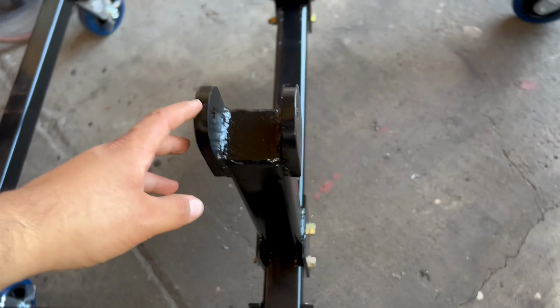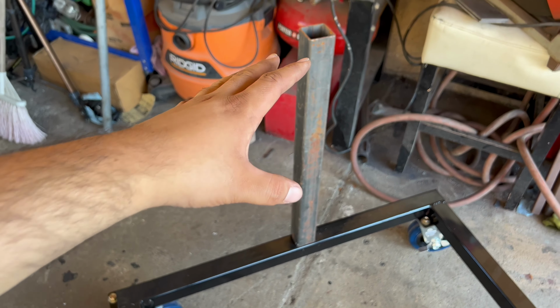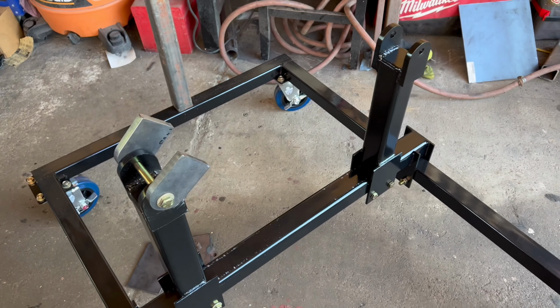The top right here will just mount to the engine like normal with the bolts, and that will complete the whole engine mount right there. I think that's going to work out really good. I still don't know what I'm going to do for the back of the engine. I think I'm just going to put a post on the back right here and do the same with the plates so that it can be moved side to side, and maybe just put some holes here with some plates right here so that I can get some bolts and put them on the back of the block. But I will have to look at more pictures and see what I can do about this situation. But let me get these engine plates welded up. I'm just going to try to finish the back, and then we'll get the engine finally mounted on the run stand. Let's do it.